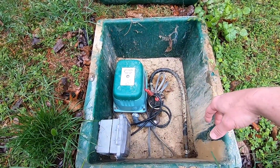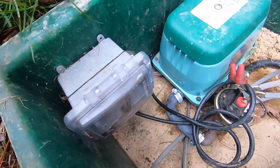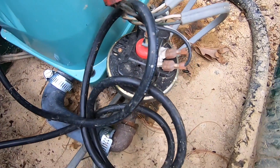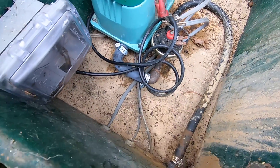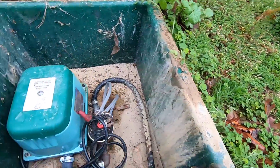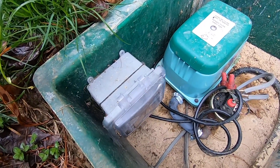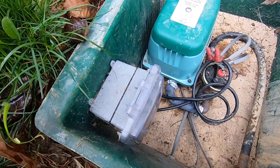Obviously there could be something wrong with the pump, or something wrong with the circuit that powers it. It's a fairly simple circuit - basically just power coming in to this box, and in our case it's plugged in, though yours may be hardwired depending on the pump type. This circuit monitors the air pressure in the line and sounds the alarm inside, and there's another wire that goes out to the high water alarm. To test, just plug something else in and flip the breaker back on to confirm you have power out here.